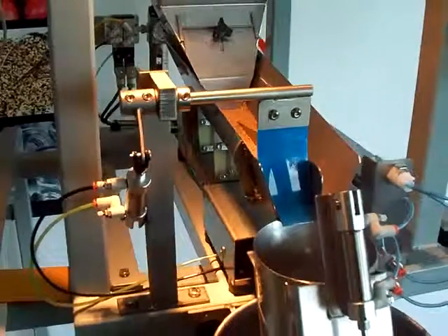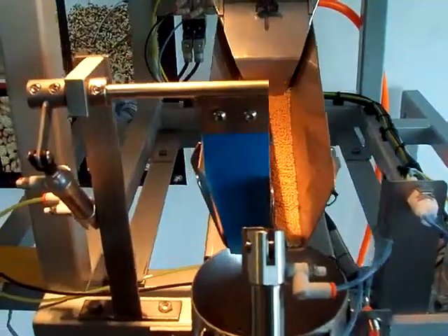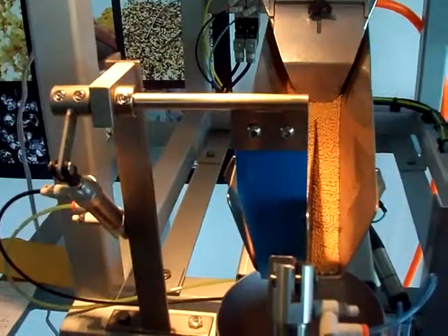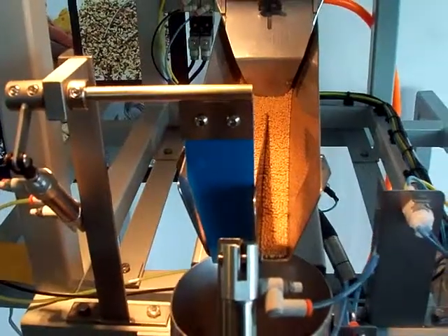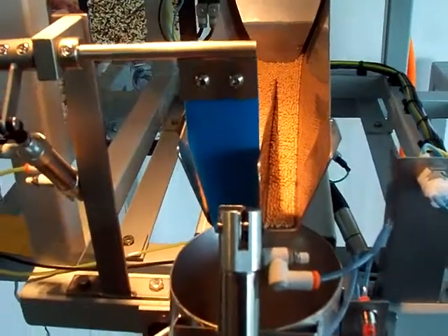A few mods that we've done here — you will see we have the bulk and the dribble lane gate. The lane gate opens in the bulk mode to get the majority of the weight out, then you have the fine-tuned dribble that gets the high accuracy.